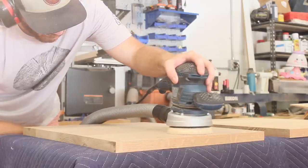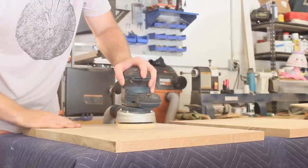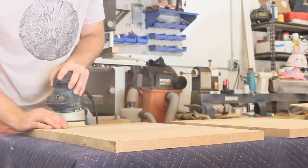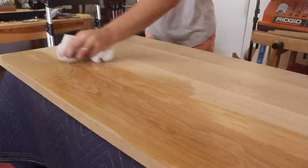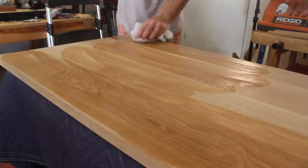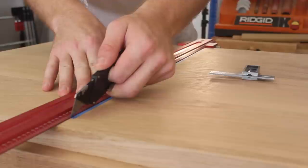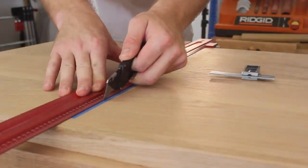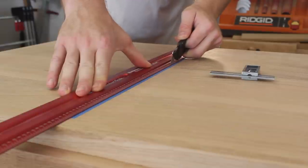Just like the mantle I made, this table will be stained a charcoal or black-brown color. In this case, I decided to use Rubio Monocoat. This or any normal stain will be tough to apply to the inside faces of a piece after glue-up, so I finished the inside and hard-to-reach places before gluing everything together. I did a lot of sanding up to 220 grit, raised the grain with some water, and sanded back that raised grain. I also masked off the areas that will need to see glue.